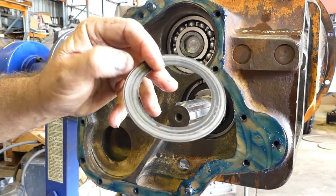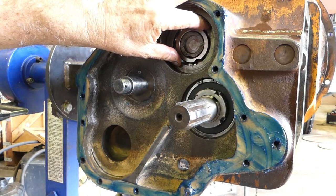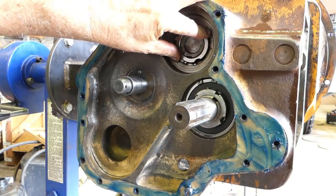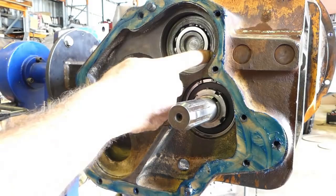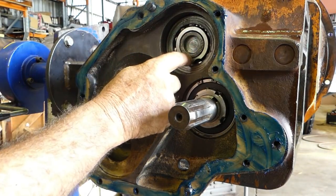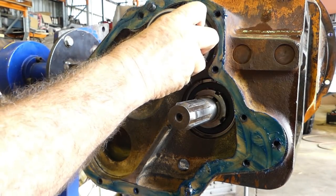So what they've done originally, they've got this spacer here. Now the spacer goes in there like that. I don't think it matters which way it goes. The idea of that is that we can actually hold pressure on the outside here and let the inside of the bearing have its own way. So, and then this fella goes in there,